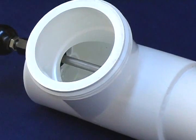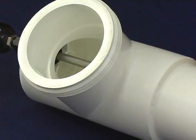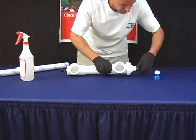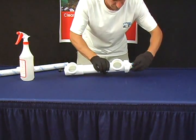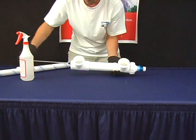Make sure that the quartz sleeve is seated correctly in the bottom of the unit. Make sure that the purple rubber seal is halfway in and halfway out of the unit. Now go ahead and tighten the quartz cap back on. Make sure that the wiper runs smoothly.